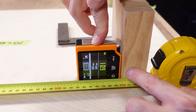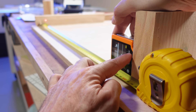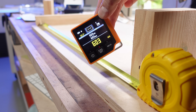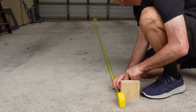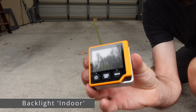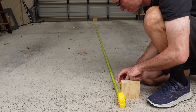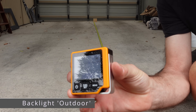I set up a simple rig to measure a 600mm distance. You have to be careful here because you're trying to check a digital laser tool with an analog tape, which is kind of problematic. I was consistently getting 601 or 602, sometimes 603, which does fall into the range. I also tested this on a longer setup of 5 meters — aiming the laser over the longer distance is a bit more tricky — and I managed to consistently get about 5001mm, which is more than acceptable. If you needed it to be as accurate as possible, you'd probably use a tape and a second person, or spend more time setting up the laser and maybe using the timer.